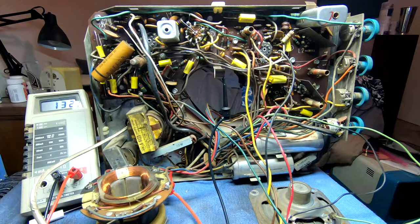So I'm just going to bring this up to 100 volts right out of the gate, since I haven't seen any leakage problems with the capacitors thus far. We're up to about 146 volts. The tubes haven't started conducting yet. That'll drop once they start.